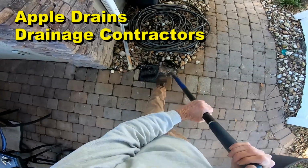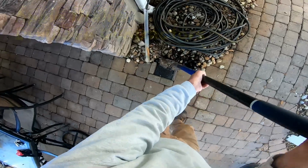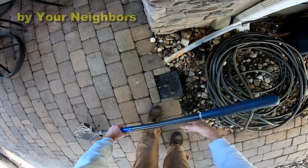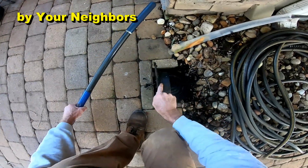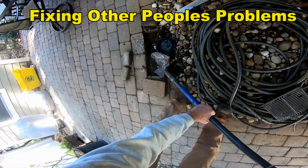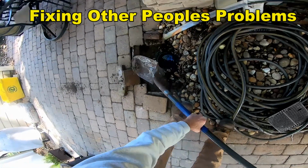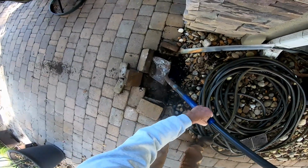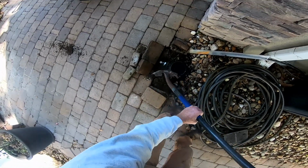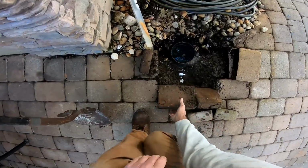So last week, when I came out here to repair the pump, the homeowner had told me that during a big rain, the paving company came out here and added this catch basin. But today she said, oh, wait, no, it was a handyman and it was an emergency. My husband knows a handyman, so we called him, and this is what he did to correct the problem. The guy tried to help, I'm sure, but he put in a catch basin, and then he reduced that line down and tied it into a 1.5-inch pressurized discharge from our pump. And this is the result.